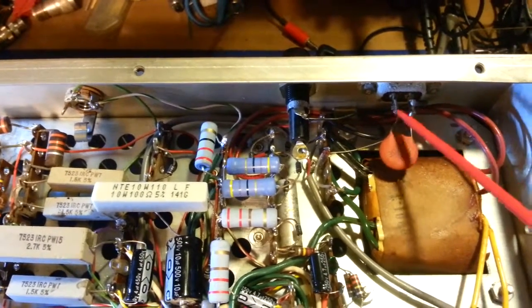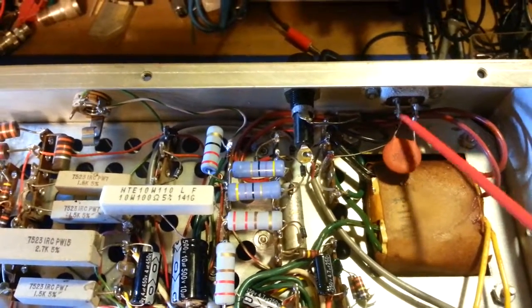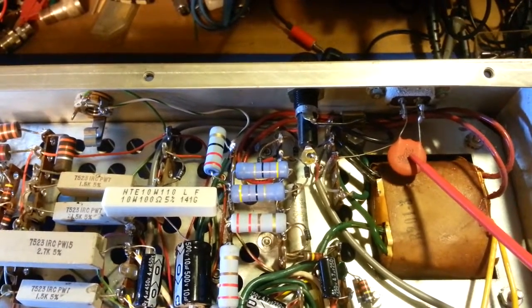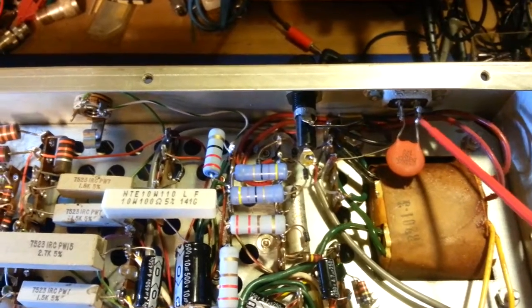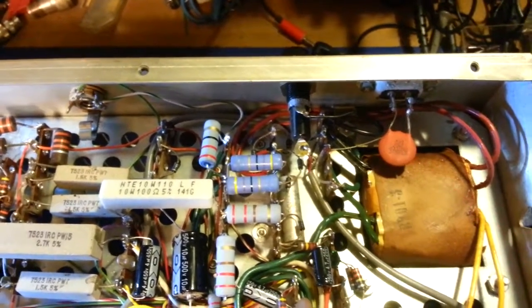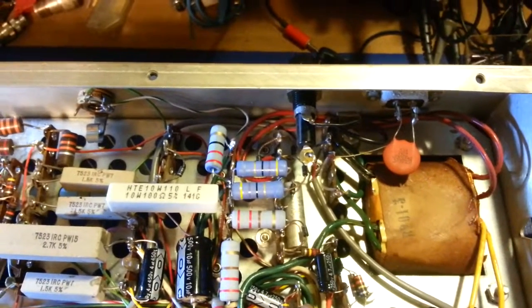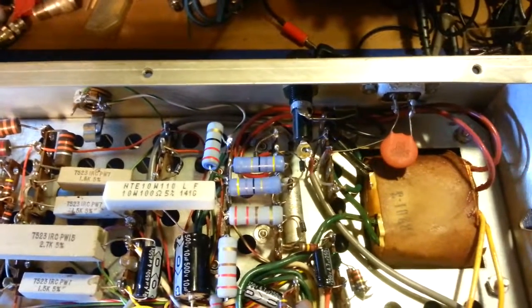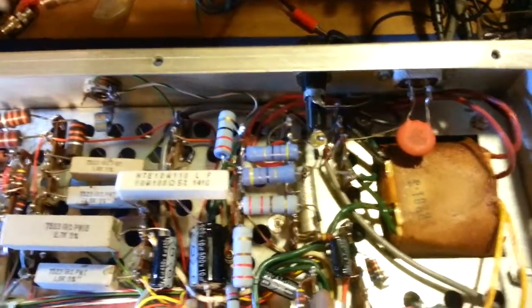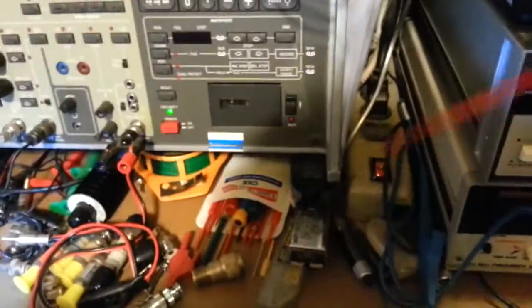So any voltage spikes come through your power line, everything. Matter of fact, that's the same pretty much for anything electronic. They're all going to have these capacitors. So like I say, even when something's turned off, these capacitors are in line 100% of the time, unless you're turning off the power to the power line using terminal power strips, which is what I do, which completely removes power, even my test equipment. End of the day, I've got power strips. I turn the power strip off, that removes power from everything.